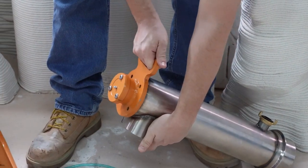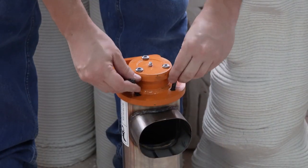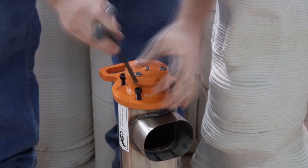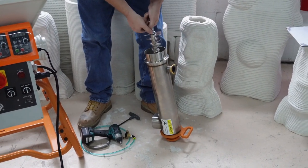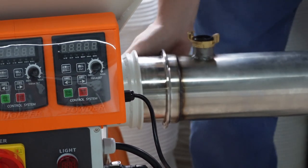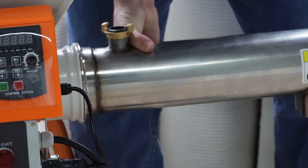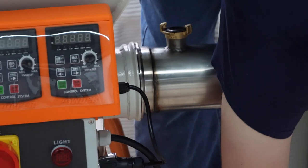When putting the end of the mixing chamber back on, make sure that the handle is on the opposite side of the material output. Start the bolts in by hand, and then tighten in a cross bolt pattern. Insert the mixing blade with the three paddles on the output side. Align the mixing blade to be inserted into the machine, then push the mixing chamber into the machine. You can use small movements as shown here to help fully insert it. The mixing chamber must be fully inserted — there should be no gap between the mixing chamber and the machine.